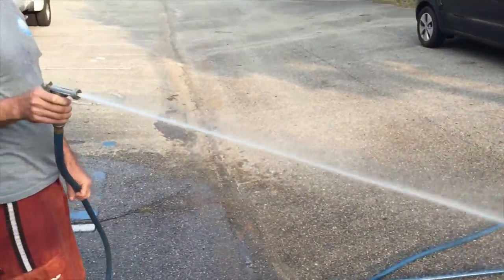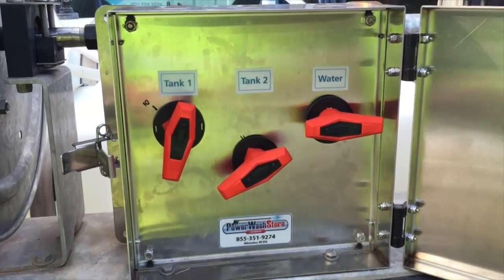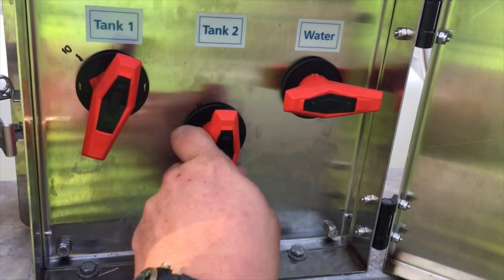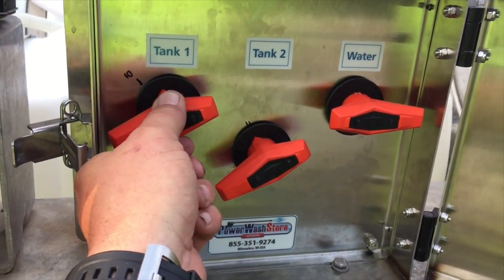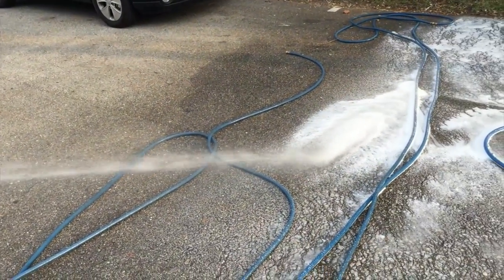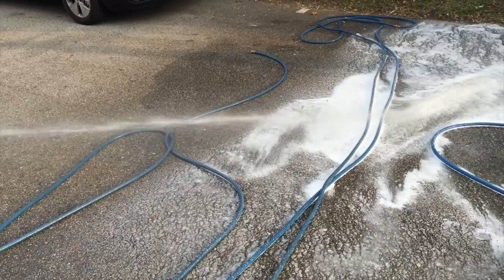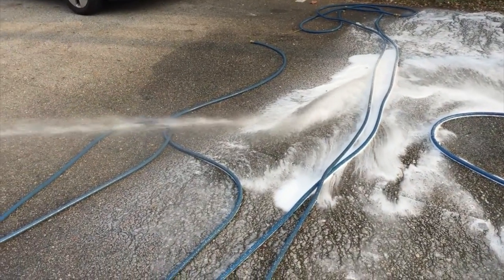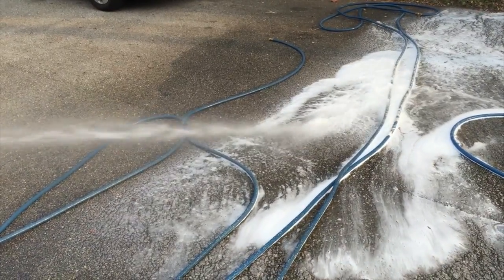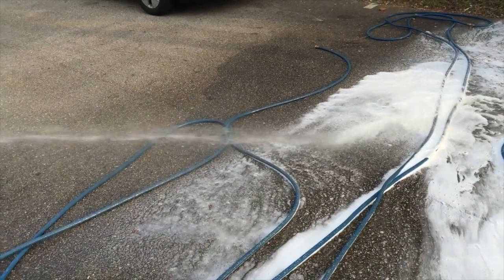On the other side of that, let's say our mixture is too hot, or we're getting off the roof and we want to shoot something less. I can come up here, again, add a soap bump, and cut this mixture back to anywhere from a 2% to 3% mixture. Whenever we see the soap get really, really thick for just a second, we'll know that everything behind that is now only about a 2% to 3% mixture.